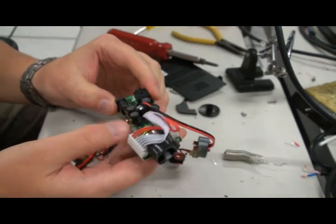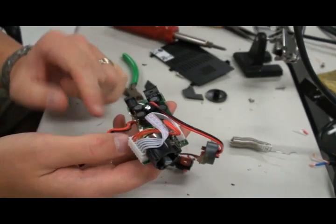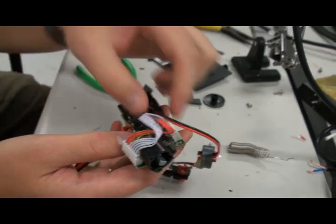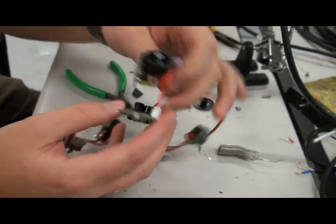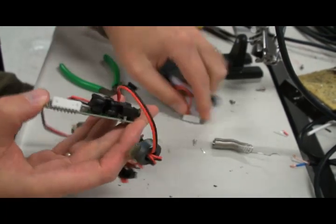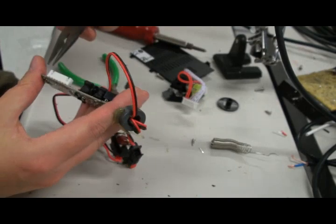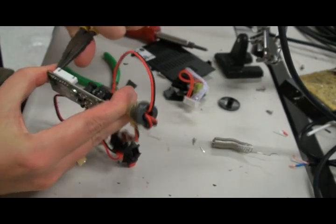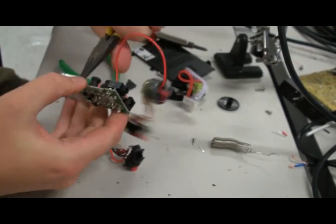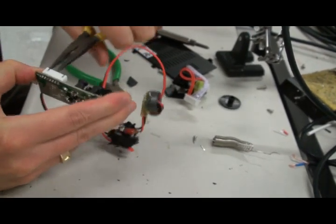Here's our amp. Later we'll worry about putting some more hot glue here because these tend to break very easily, as we found out. What we're getting rid of now is the pot — we'll not be using this part at all. It will pull off this plastic. The best approach we found is just gently pulling on each end until they give. We want to be careful not to damage the actual board underneath.